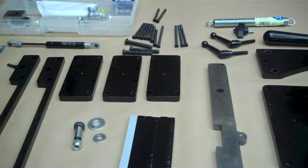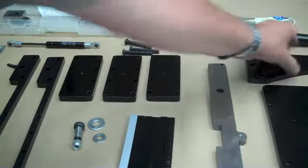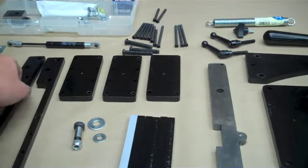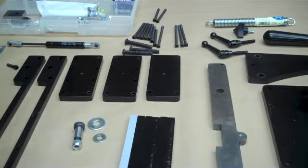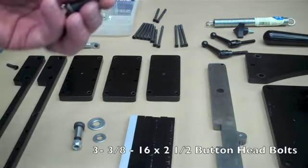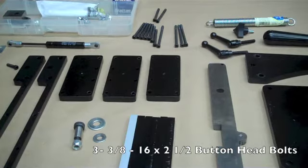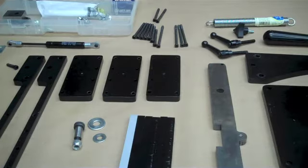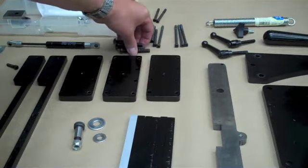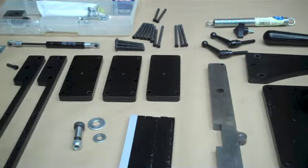It just depends on what flavor you want to go with. We're going to talk about how we're going to attach our upright. This is our idler arm upright, and it goes along with these two spacers right here. If you look on Jamie's website, polarbearforge.com, he does have an assembly page, and this is where I'm getting all my info along with some of the stuff I'm finding on the forums. Those are all going to be attached with three-eighths by 16 bolts — they're two-and-a-half inch, three-eighths by 16 — and I use the button heads in this case. It's just for a look thing for me. You can save a little bit of money and go with regular bolts.